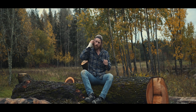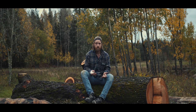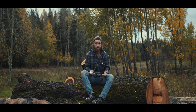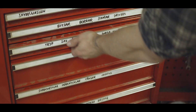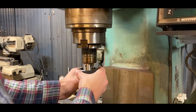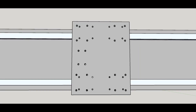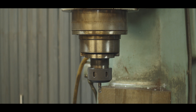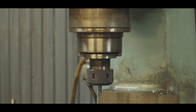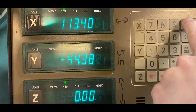What I had to do on my part was to machine this chunk of aluminum. I do have a milling machine and a lathe, though I don't use them often — mainly for small stuff. The problem with machining is you're so dependent on tooling, and I did not have the proper tooling for this job. My milling machine has an ISO 50 taper and takes OZ collets starting at 10 millimeters, but all the holes needed to be six or eight millimeters in diameter and I don't have a drill chuck for the mill either. These collets allow the machine to work with very fine tolerance as they grip the tool very precisely around its diameter.